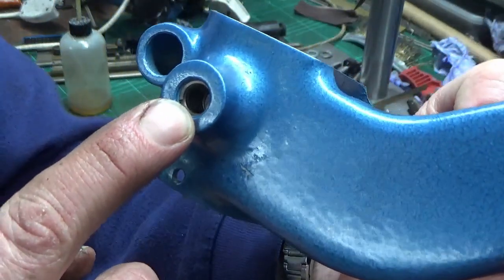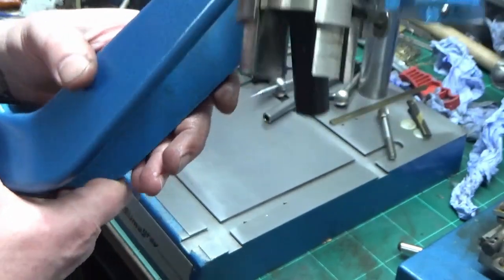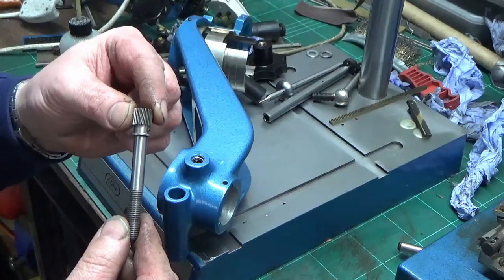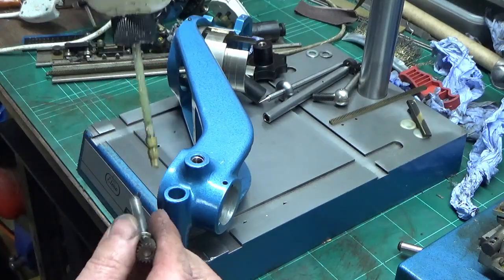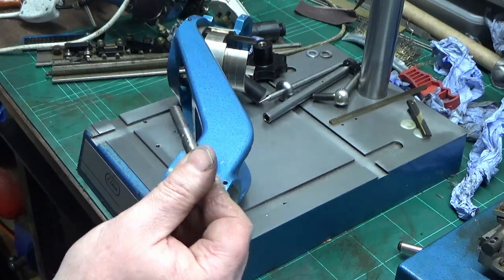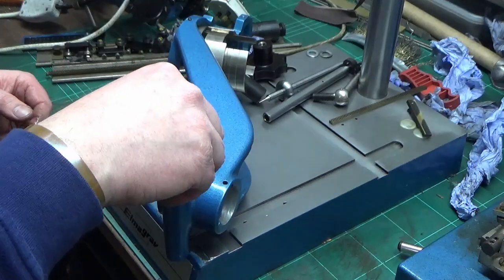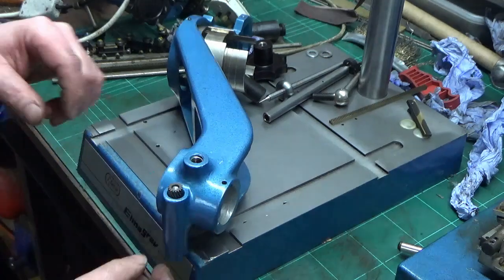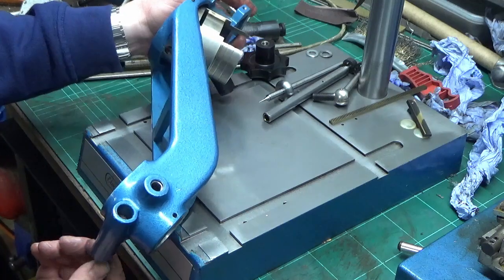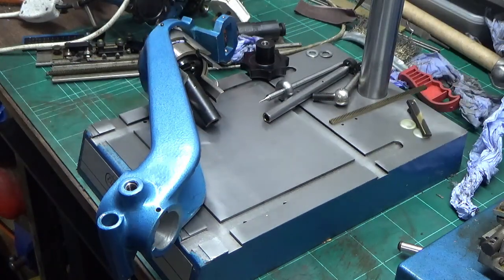Going back to the helicoil thread - I've never come across that before on a new manufactured machine tool, so I'm presuming that's done from the factory. We've got our straightened out pinion and shaft, we're just going to drop that back in. I had to take it out with quite some force because it was bent, but now it's spinning quite nicely in there. That's certainly going back in a lot better than it came out.